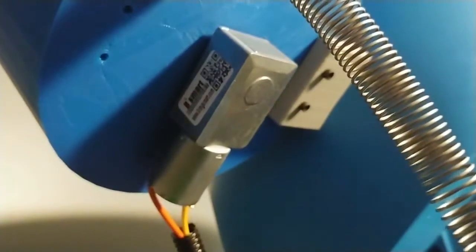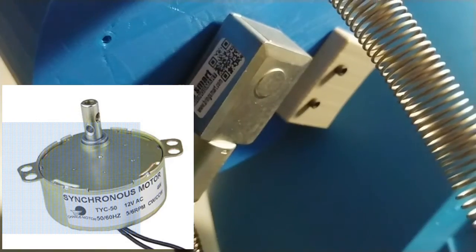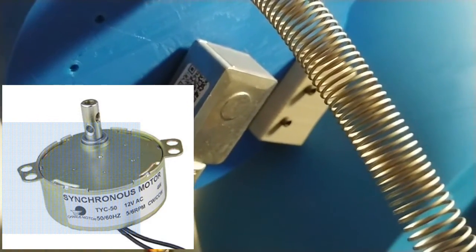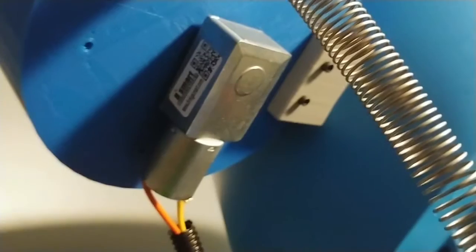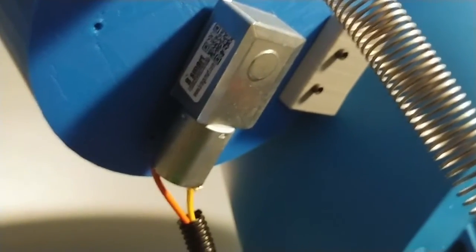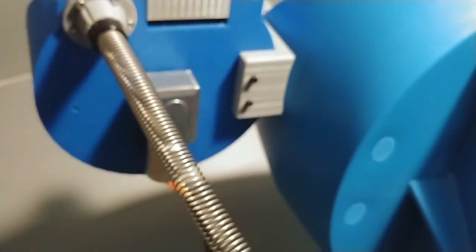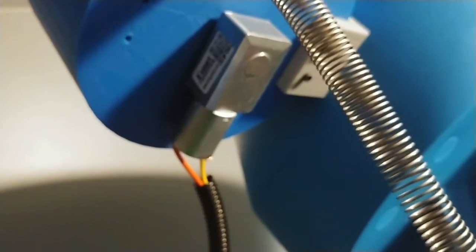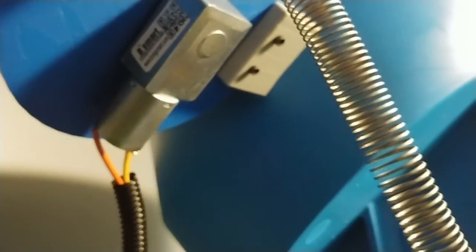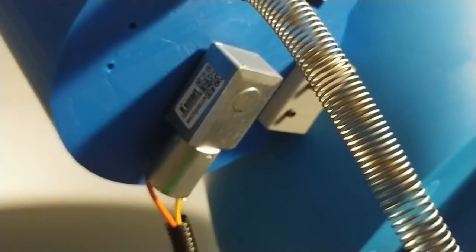Speaking of power supplies — this is the 370 worm gear. If you get the Chances motor, that's a synchronous motor. What a synchronous motor does is, once it gets so much force on it, it spins in reverse. The synchronous motor uses at least a 3 amp, 12 volt AC adapter — so make sure you get a 12 volt AC adapter that's at least 3 amps. I've seen some people say their motor won't work on less than 5 amps. To get up in that 5 to 10 amp range, these little power supplies aren't going to cut it — you'll actually have to get a laptop power supply and cut the wires yourself.